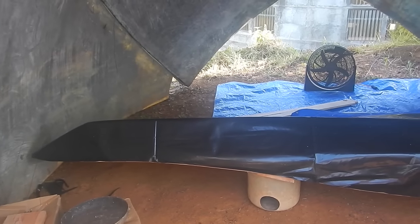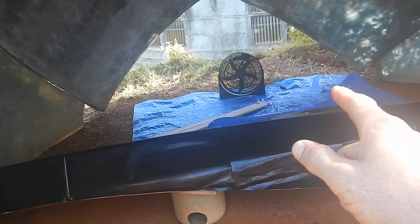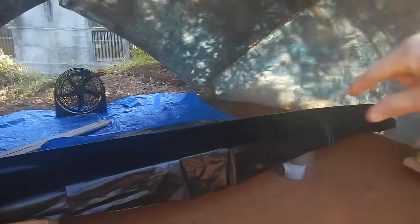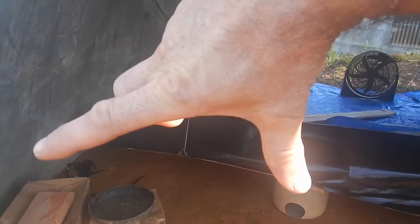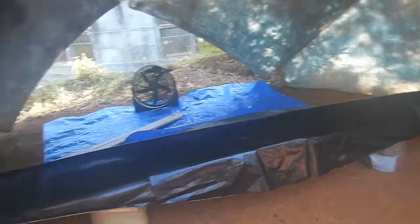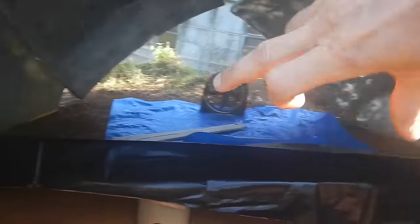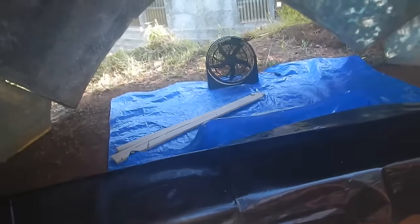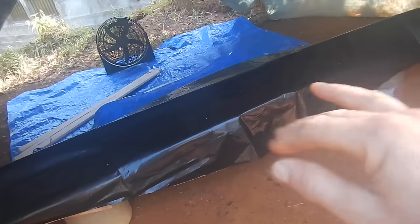All right, now I think what I'm going to do with the fiberglass is not cut one long piece across, because then there's going to be huge pieces of waste, right? Instead, I'm going to cut the 4 foot section, 4 foot section, 4 foot section, 4 foot section. And if I cut them one that way, then one that way, then one that way, and one that way, it should end up making no waste. And since it's the mat, it doesn't really matter if it's one continuous piece. They overlap and the fibers get into each other anyway. But if I do the woven fiberglass, I would want to do one continuous piece, because then I would have fibers going all the way from end to end.